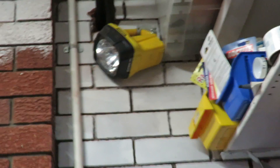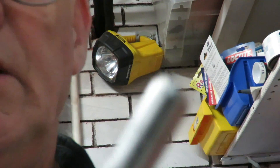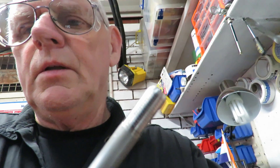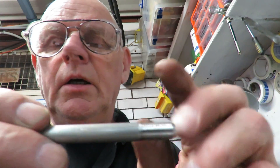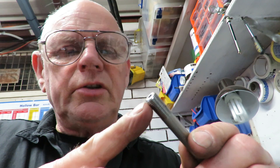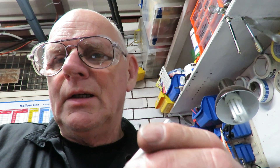I can tell you why it's locking up like that — the battery's almost down, that's part of the problem. So anyway, I did a trial thread on this side and it didn't look right — it just did not look right. I asked myself what's going on here, grabbed hold of the cutter, and I had an Acme thread insert in there. So I swapped that over and then made the second cut which was the proper one. Battery's almost flat — got to say goodbye. We'll get this sorted out tonight and we'll be back in business. See ya.